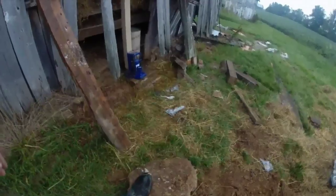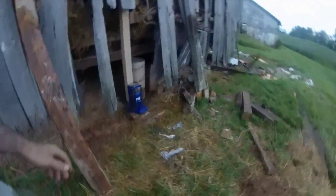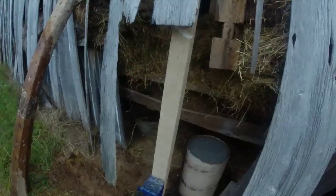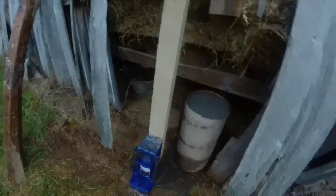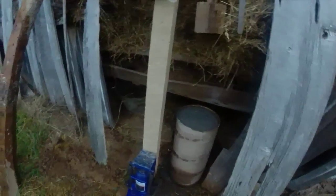This was what was holding the barn up — that was underneath the post. Now we've got concrete going 24 inches in the ground, probably a two-foot square, and then I've got 24 inches sticking out.